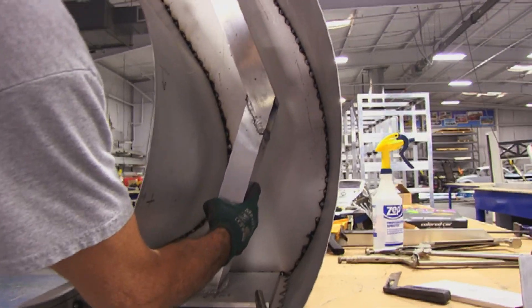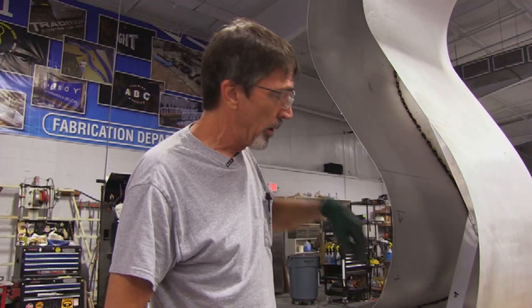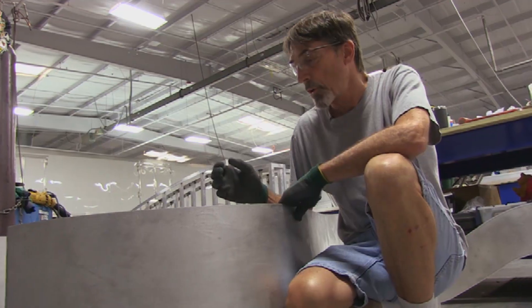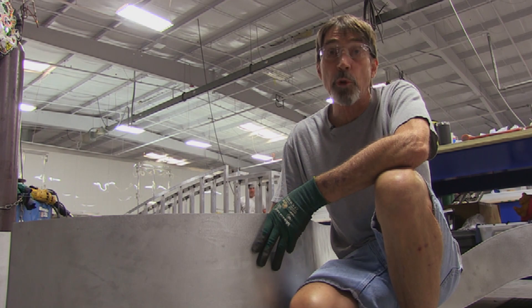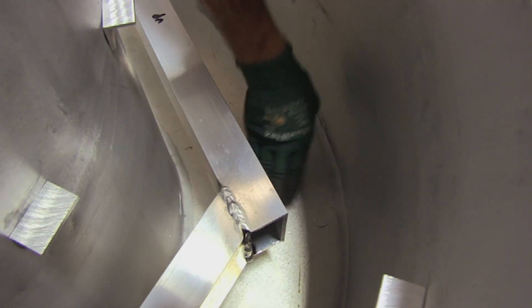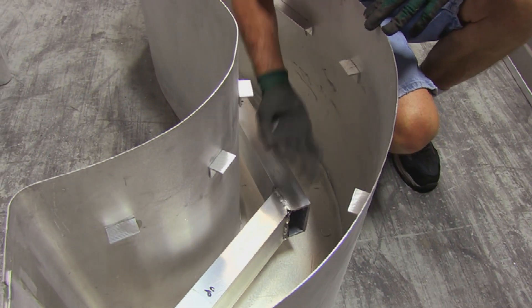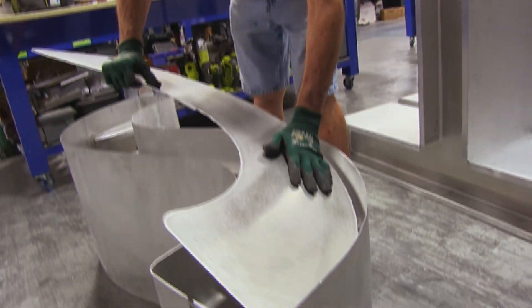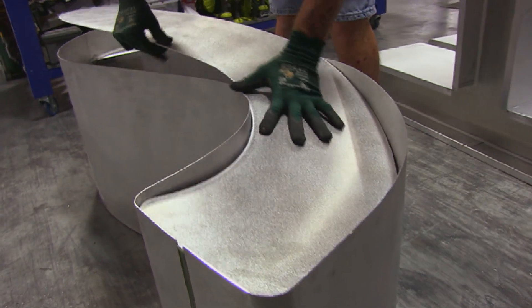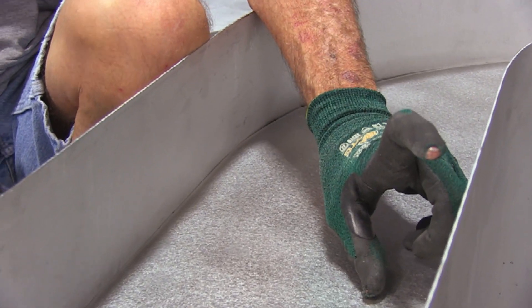This piece probably weighs about 40 pounds, and once I attach it to the back of the cabinet and to the top, a semi can drive through it and probably won't even scratch this letter. The 20-inch letters also need a false bottom inside. The LEDs all the way down on the bottom will never shine up this high, and you can't put them on this piece of framework in the middle. So I glued some tabs at 5 inches where I'm going to put a false bottom — that's the exact preferred height of 5 inches from the face for my LEDs.